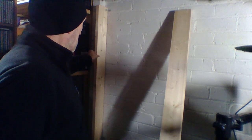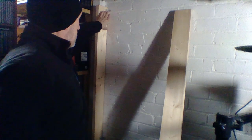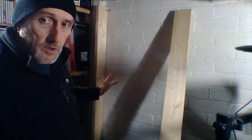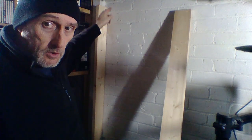So I've fixed them on the wall. Now there are your brackets — you've got two up here and you've got two down there. That's all this one's going to need. If it was the full size of the wall I'd probably put four brackets in there — one at the bottom, one at the top, and two spaced equally on the joist.